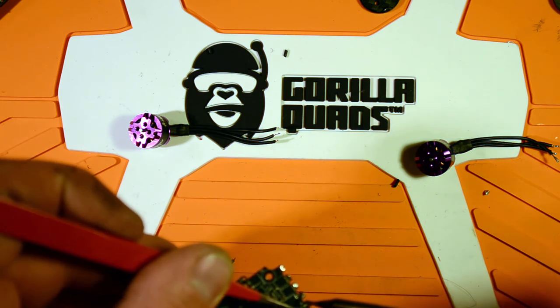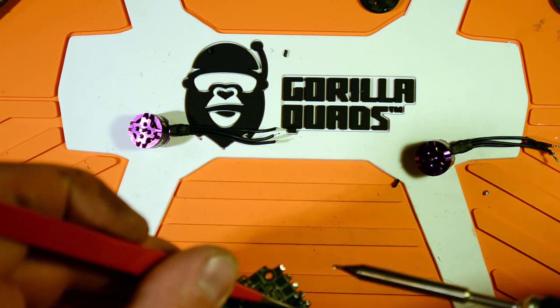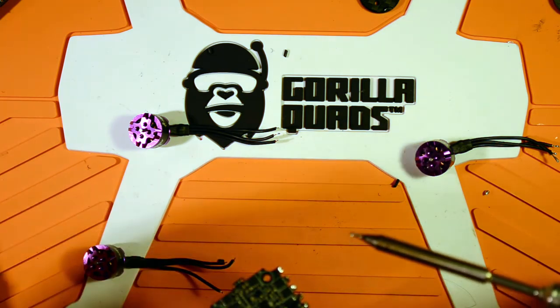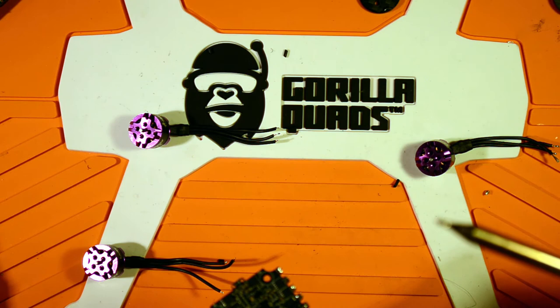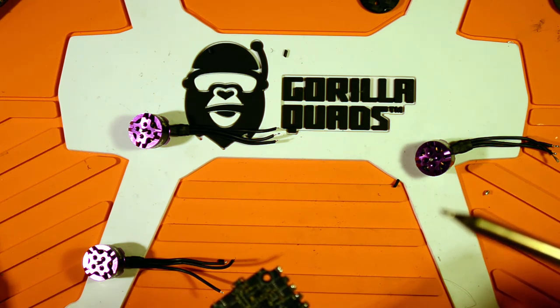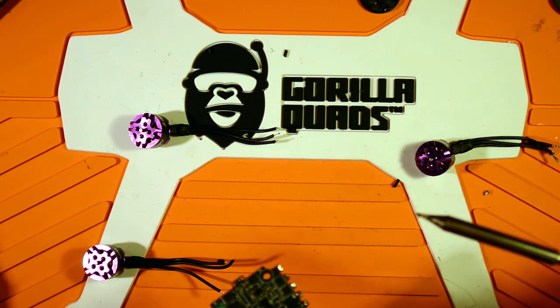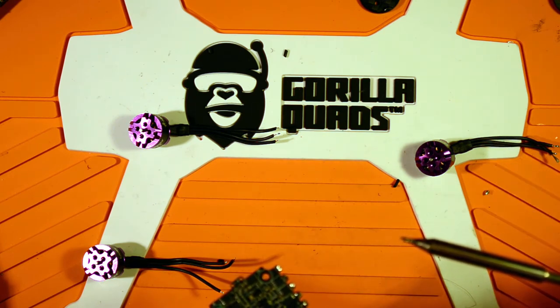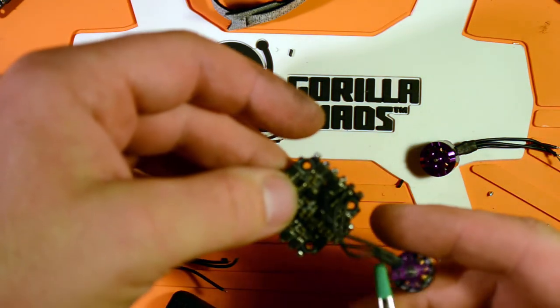Oh, by the way, I've already gone through and tinned the pads on this flight controller. Always tin the pads first. It'll just make life a lot easier for you, because you won't have to add as much heat or solder. You can get in, get the wire on there, and get out real quick. Just like that. And you want to hold it there until it kind of flashes over a little bit duller of a color. Soldered up. Let's try this again.